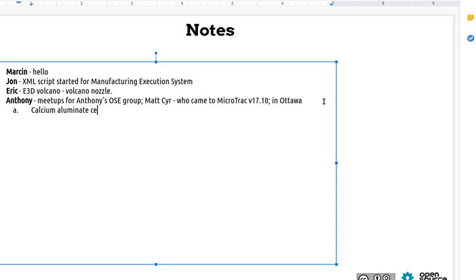What's wrong with silicate? Silicate is okay, right? That's sand, right? It works okay. It just starts to crack at, I think, 1,100 degrees. It has various phase transitions. The crystalline structure changes, and that causes distortion, and so the little grains tend to crack. It's also an OSHA inhalation hazard. Well, I wouldn't call it silicate, I would call it silica, silicon dioxide. It's just sand, like you say. It's just not the ideal filler. The ideal filler is something more like alumina or zirconia.